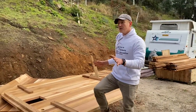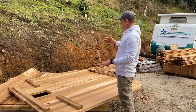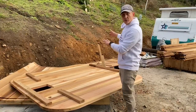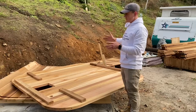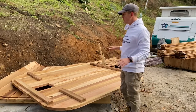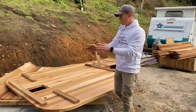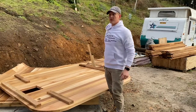Both walls are assembled and we're ready to put them in position. We'll start with the back wall. Even on a calm day with no wind, it would be handy to have an additional person to hold the wall while someone else installs the second wall. We'll temporarily put a couple of blocks of wood to hold the back wall in place, then bring the front wall and put a couple of staves over the top to secure both of them.